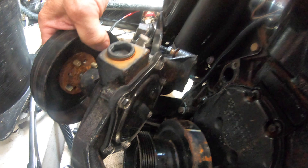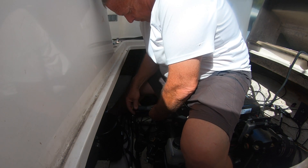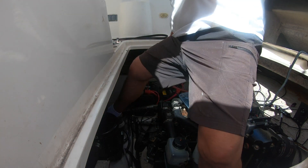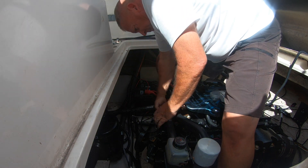I have to be honest — I don't have a manual, and I thought that this was the water pump where the impeller is. It's actually a recirculation pump, but I needed to remove it anyway to make it easier to get to. Here I'm removing the hose clamp that holds the hose onto the top of the recirculation pump. To give you an idea of how difficult it is to work on this engine, I have to lie on top of the engine on a piece of foam and hang upside down to get to everything.